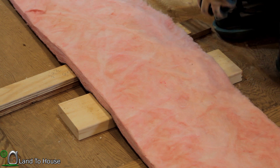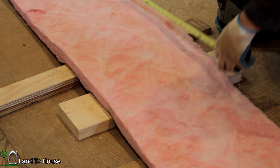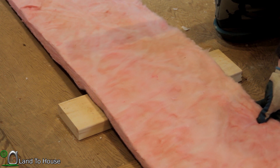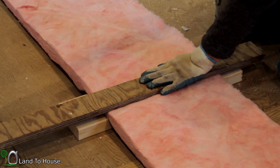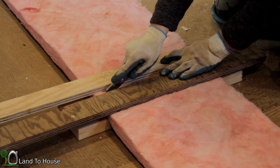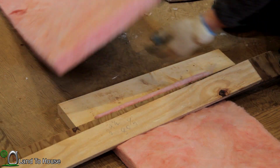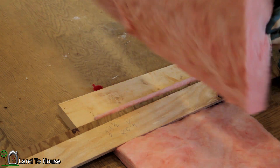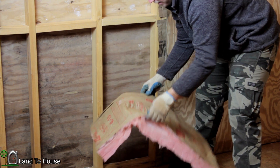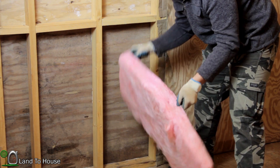I want to find 36 inches here — right here. Got that marked down. Get that lined up on the center of my board, take these two pieces and press the insulation down, then I'm able to just take my razor and cut down pretty simply. I'm going to take this and just give it a light shake facing downward to fluff the insulation a little bit. Okay, gives it a lot more volume there.